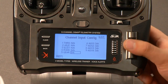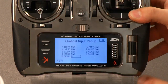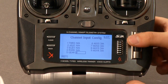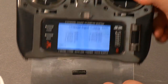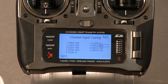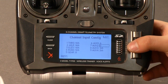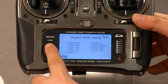For the gear channel, we want to set up our flight mode switch on switch B. This is my preference — it's the same as helicopter flight modes, and it's the switch right here on the top of the radio. You can put it wherever you like; the DX9 is fully assignable. Then on AUX 1 we want to set up lever switch A — that's the two-position switch back here. You can just cycle it and the DX9 will select A, or if you don't have the newest firmware, just click and scroll to A. For AUX 2, that's going to be the actual slider for the gimbal itself. You can put it on the knob or the left and right slider — I like it on the knob, and that's also how it is in the manual. We'll scroll over to right knob. Once that's selected, everything in channel assignment is done, so we can hit the back button and go back to the normal screen.